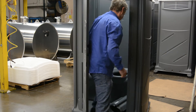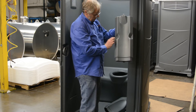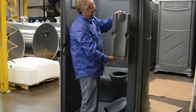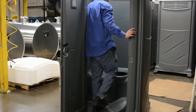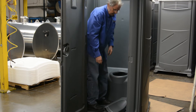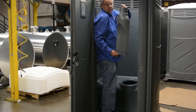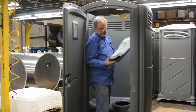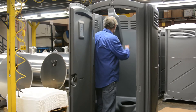Shove the bottom vent pipe section into the large hole in the left rear corner of the tank. Take the next section — the center section — which has two ears on each side and the coat hook up, and shove that into the bottom section. Then this is the top section: just stack it on top, with this part going into the center section.